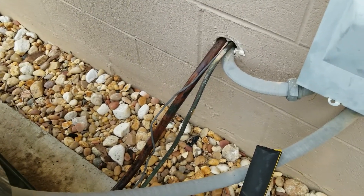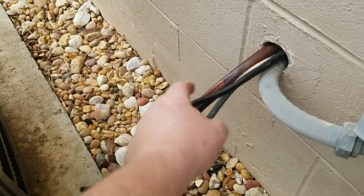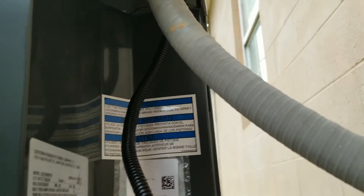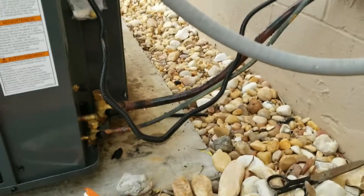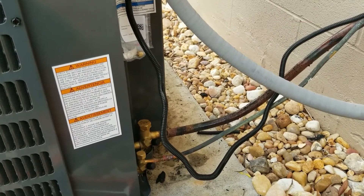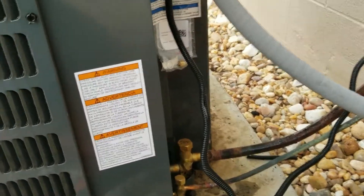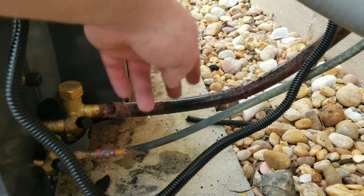As you can see, I've got the wire loom over that wire and pushed it back up in there a little ways, all the way up to the bottom of the unit. So it's going to protect it from rodents, and if you want to hit it with a weed whacker or something it's not going to tear into it as easily. I'm going to secure it even further.